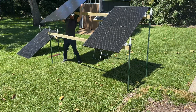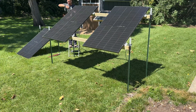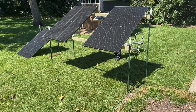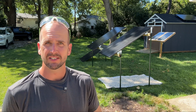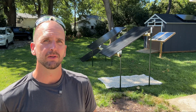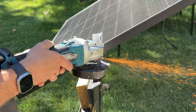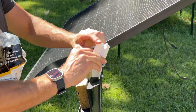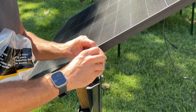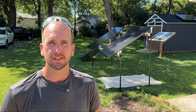Grab the other panel and space it out — you do not have to space them like this; this is just for the testing I'm setting up for. To finish it off, if your T-posts are extending out, for safety and to eliminate shading on your panel from the T-posts, cut those off with an angle grinder and a cutoff wheel. There are little caps you can get — link in the description — to make sure there are no sharp edges on your T-posts from a safety standpoint.